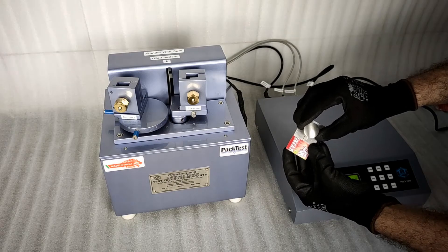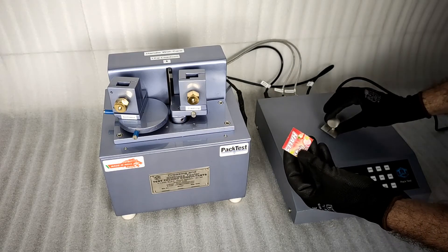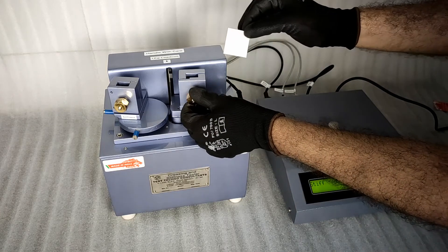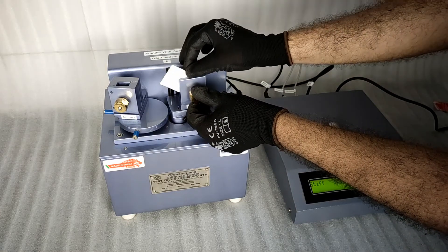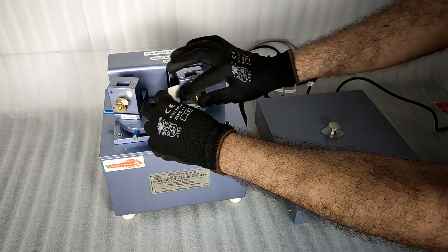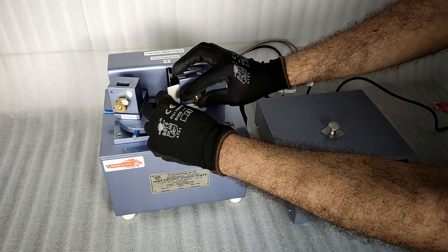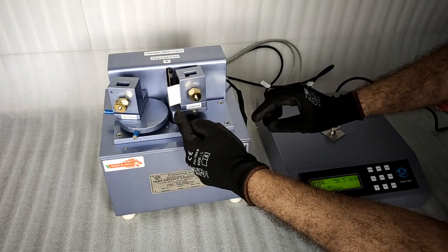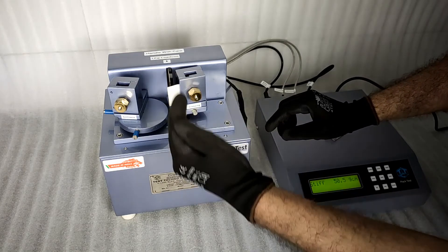Creasing test. This is the cut sample as shown earlier. Do not bend while handling. Open the brass knob on the front of the fixture to open the grip face. Insert the sample and tighten it back again. The scoring line of the crease will be approximately 3 mm out of the grip and in the same axis of the motor below it.